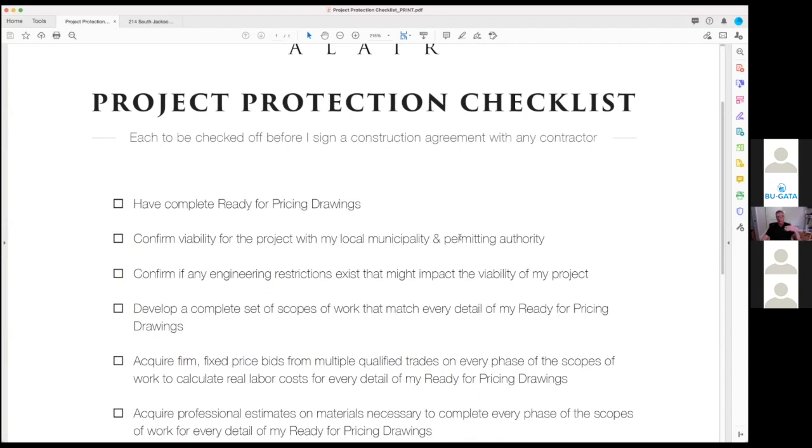You want to make sure in Arlington County, lot coverage is the most important item to worry about. If you have a 5,000 square foot lot, an R5 lot, R6 lot, there's R8, there's R10, all those different zone lots have a different percentage of lot coverage you can cover. The folks up at the BZA and zoning will tell you that they'll be relatively flexible with setbacks, because of when the zoning ordinance was implemented, there are lots of good examples of houses that sit a little closer to the property line on one side or the other, a little closer to the street on one side or the other.